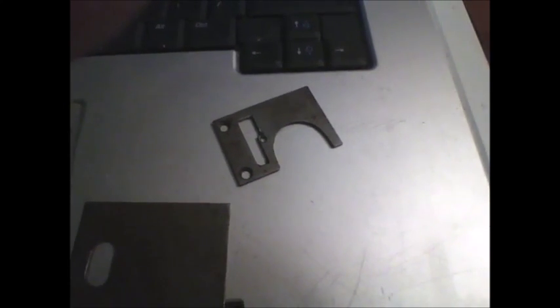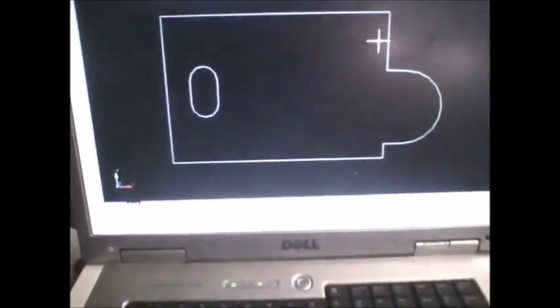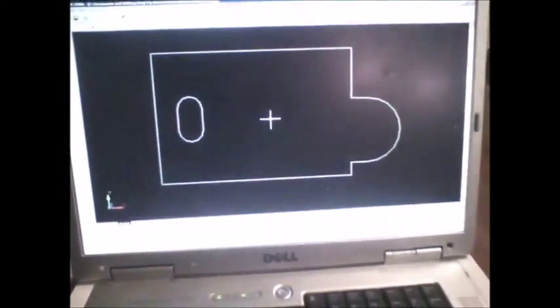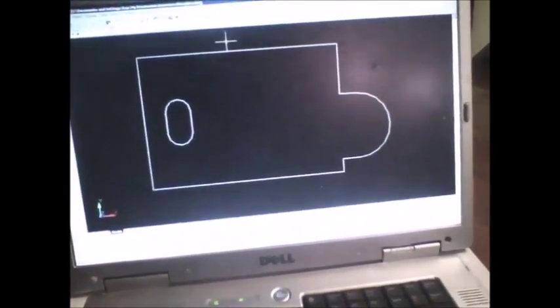This part here is where the new stitch plate would slide into. Unfortunately, that's a very hard piece to machine. I've made a slide plate before, but never had to make one with this funny protrusion on it. So I got the measurements I needed off these two plates and drew them up in AutoCAD. What I've got right here is the two-dimensional drawing, which is what I would need for the CNC mill.